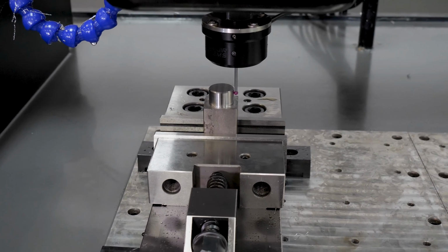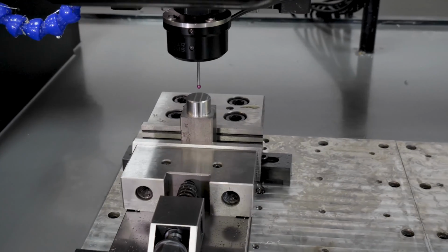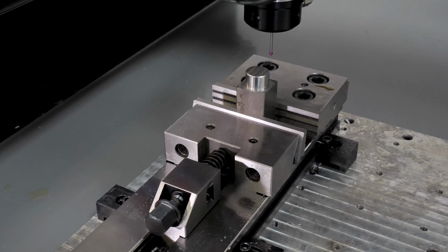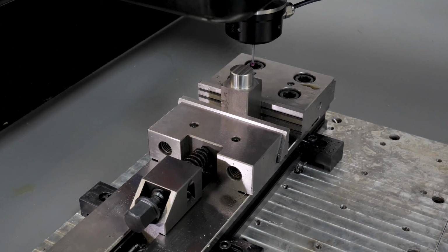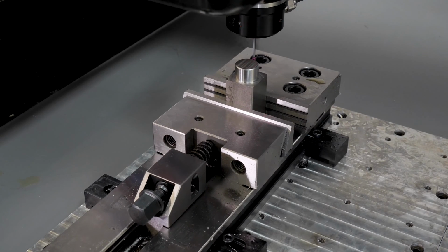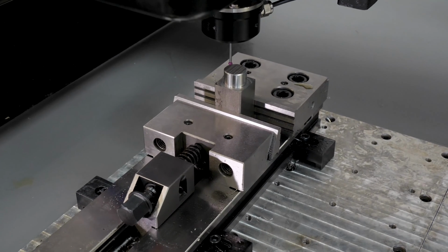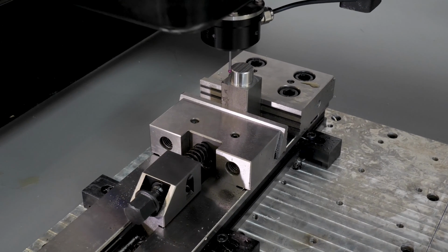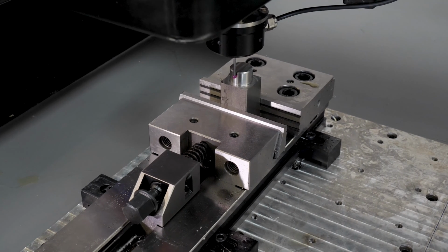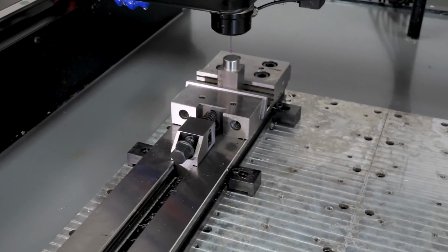So you'll notice it used that buffer distance and came out about a 1/2 inch extra from that estimated diameter. That's good, that's what we want. Now we're going to be doing the same thing in the Y direction. And again, I'm just showing this for the tutorial, so I have everything set pretty slow here. We recommend when you're new to running these routines, you're not really optimizing for any all-out cycle time. Just use reasonable feed speeds. I think we have 15 inches a minute for this cycle. So it's coming up, and then it's going to move back to 0.